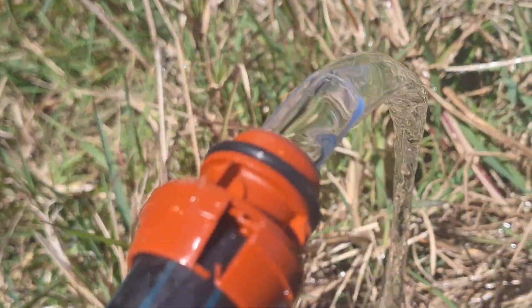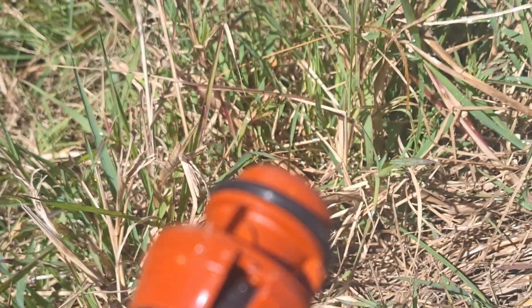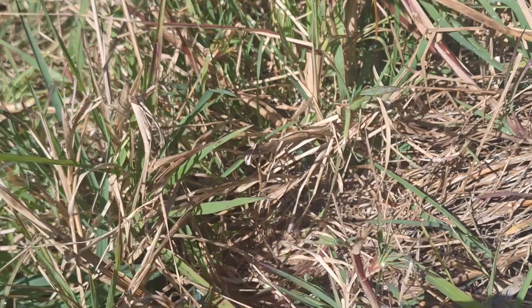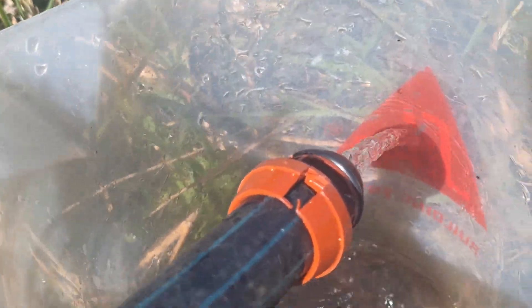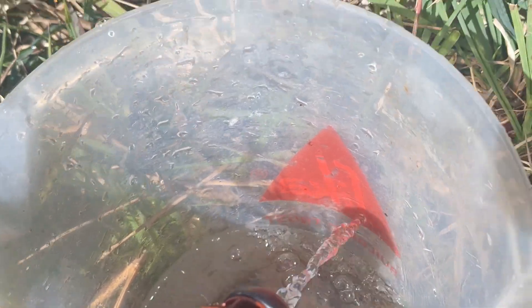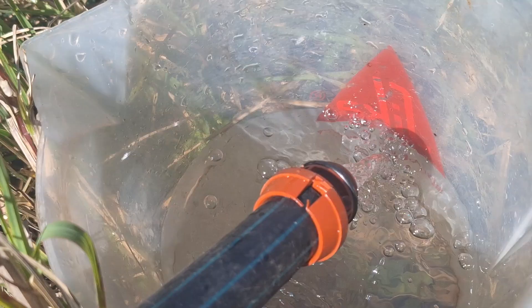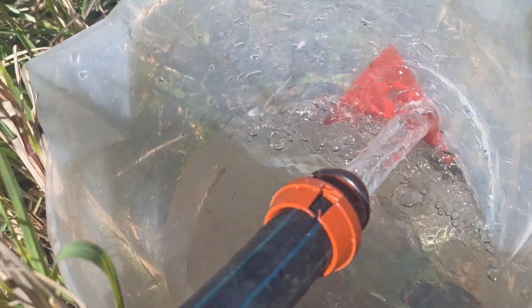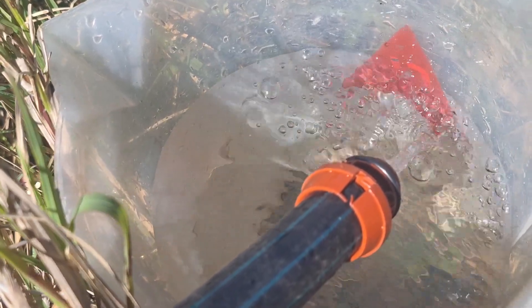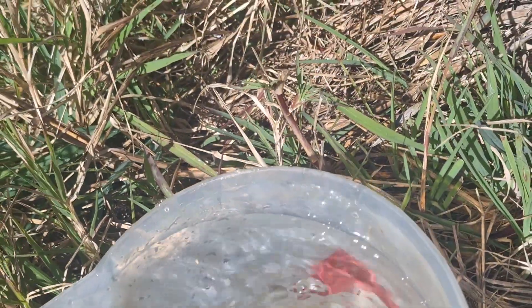So this is the output of the Bunyip pump with a 98mm or 4-inch bore. It's pumping about 7 and a half litres a minute. We're using a 5-litre jug — it should take about 40 seconds to fill the 5 litres. And there's the 5 litres now — a bit over 40 seconds.